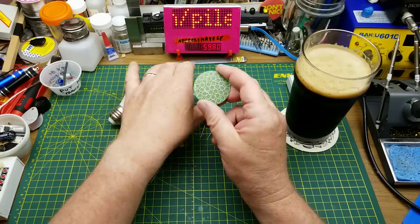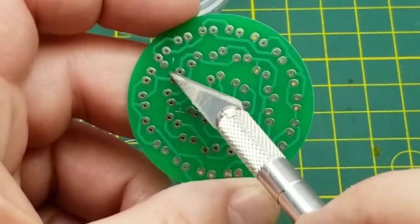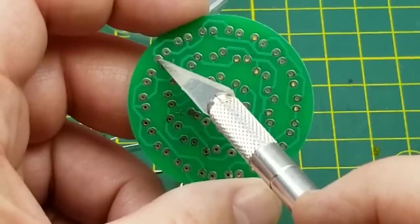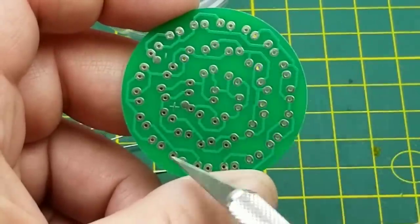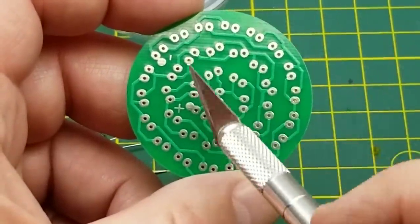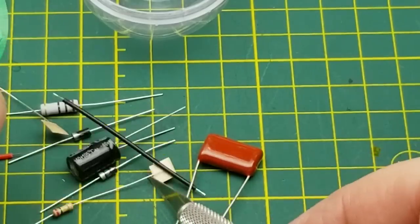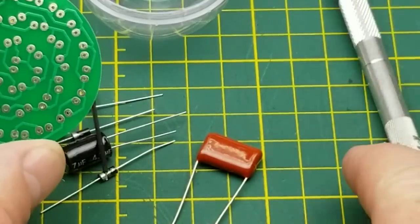This is the little circuit board that holds all the LEDs — 38 of them. As you can see, they're set up as 19 pairs of LEDs in parallel. There's the first one, negative side in parallel with that one, and it just carries on all the way around the board until you get to the middle, which is the most positive. Kind of annoying that where the wire comes off is just a surface mount pad you have to jam the wire onto, but we'll make do.